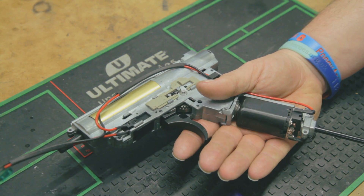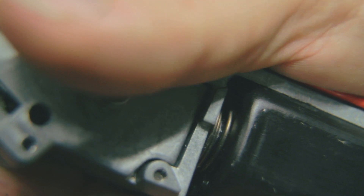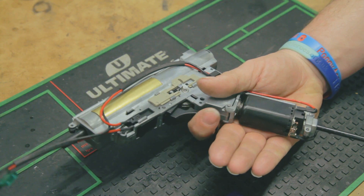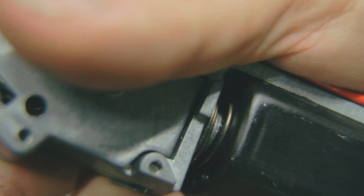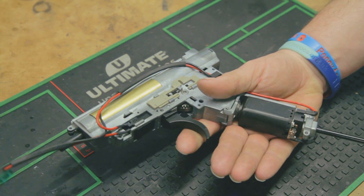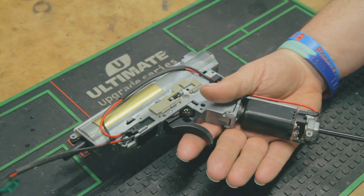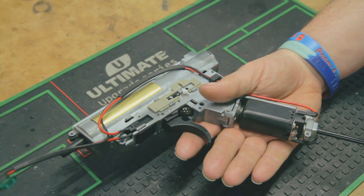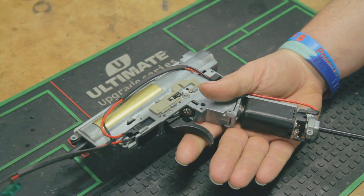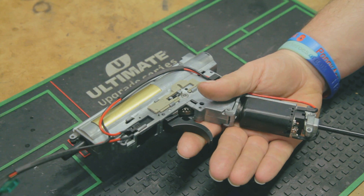You can also go the other way — if you go too low on the motor height adjustment, the pinion gear and the motor are not meshing with the bevel gear. From there you'd have to go back up until that horrible noise goes away.